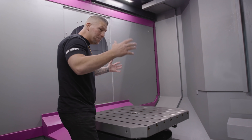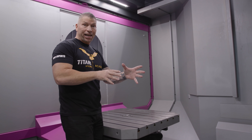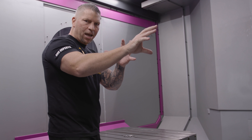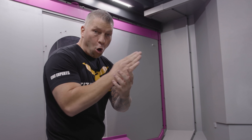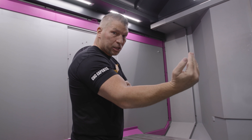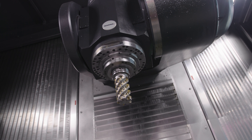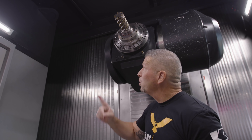When you have a massive part sitting up here, depending on the application, you're going to have deep cavities and therefore long tool sticking in and milling at the bottom of a pocket. So your spindle connection has to be nice and big, the spindle needs to be an absolute beast. And to do that, right here we have the Kessler spindle — this thing is an absolute monster.